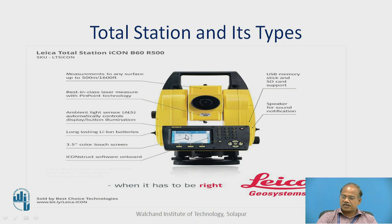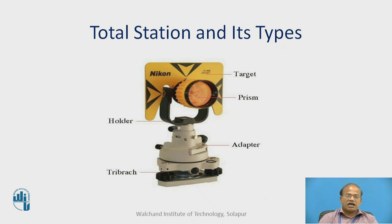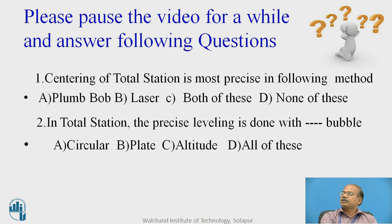The digital bubble can be seen right at the beginning when the display is made on screen. A prism is required in case of the total station; it is needed to set the height of the prism. There can be a rod on top of which the prism can be fitted — it can be removed from its holder and fitted on a rod where height markings are already present. The prism can be used in different ways, and particularly in resection, use of the prism is of utmost importance.